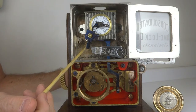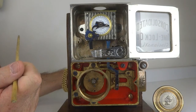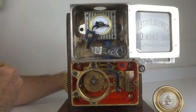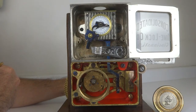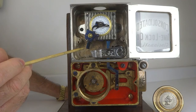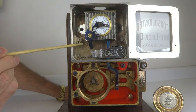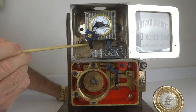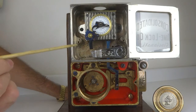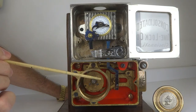Now, you're going to see that once you do that, this is then put on guard, and this will move backward, you see. So once again, you've dialed in the secret combination. You now go for the correct combination, and watch very carefully here. Within a few seconds, this always pops back, and will always do that as long as this mechanism is running, because there's a small lever that's connected to this that rides upon one of these wheels. So if the time lock is running, the wheel is turning, and this will always snap back, which of course then prevents this from being able to be opened.